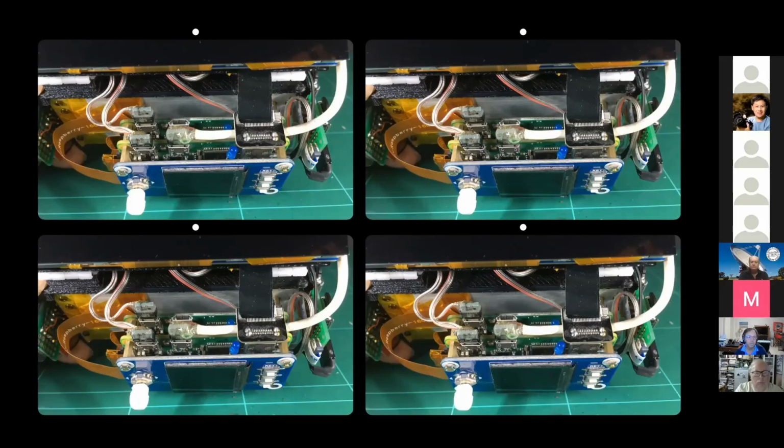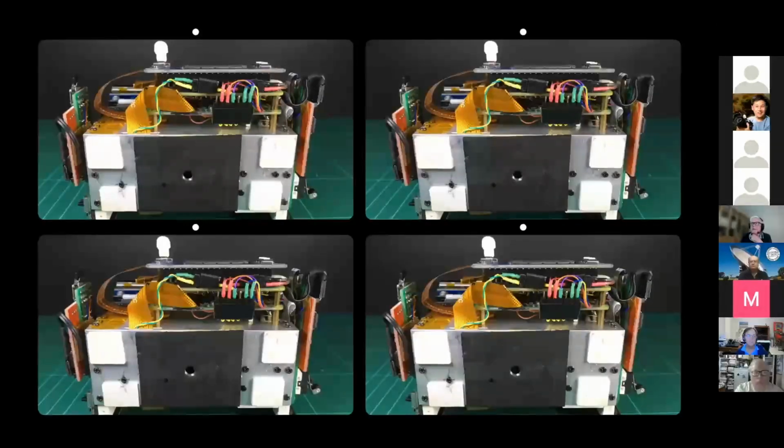The big loop on the left, in orange, that's the connection between the Raspberry Pi computers and the camera sensors. And you need that big loop there, because as the camera moves backwards and forwards, it needs that flexibility to be able to remain connected. Okay, this is the view from the bottom, just to give you an idea of the wiring. I tried to keep everything modular and unpluggable, so you can pull it apart and put it back together again, which is often required, unfortunately.